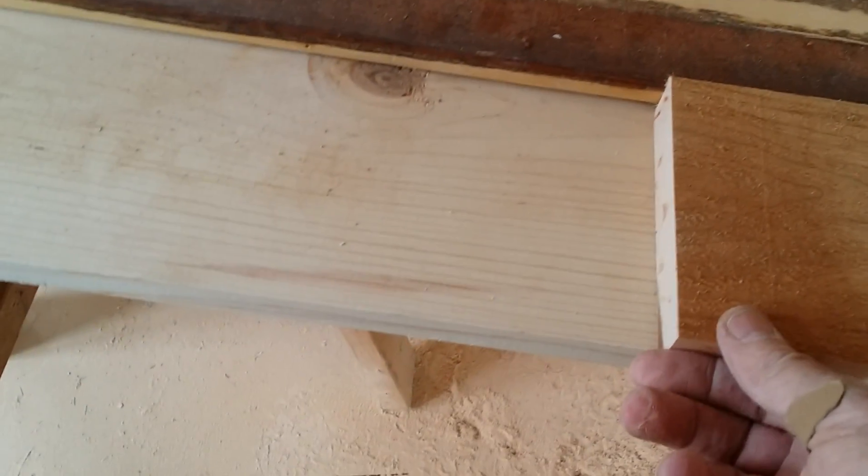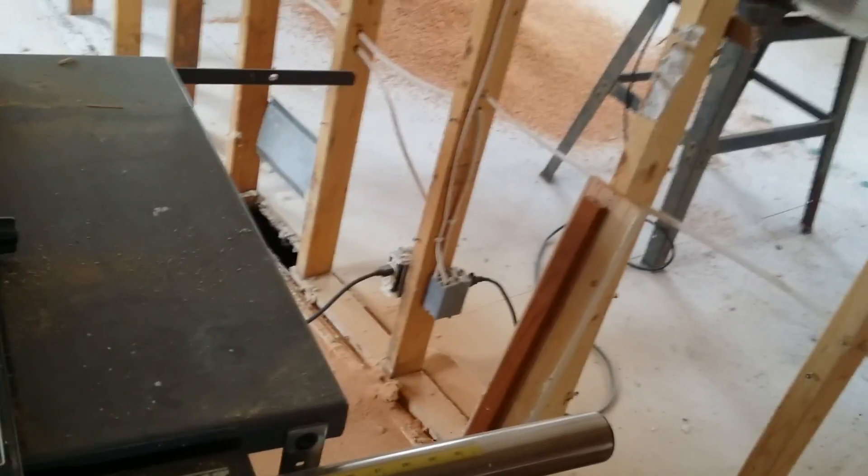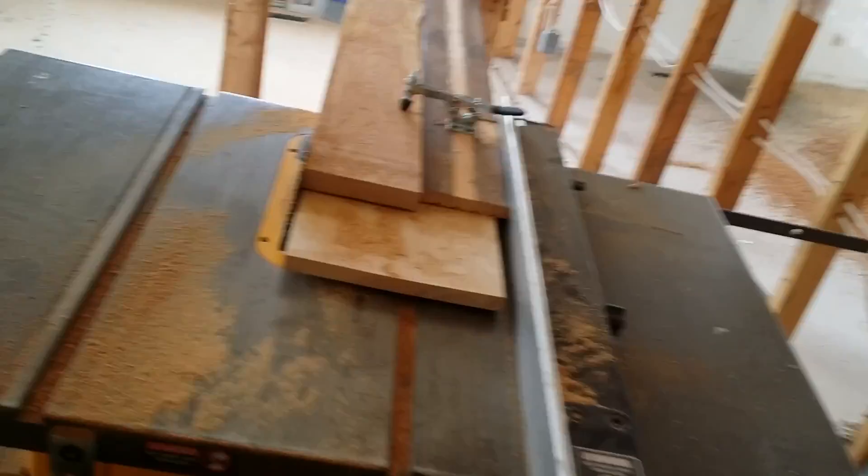What I try to do is have a little bit of extra wood from this board — which is my cherry board — so that when it hits my saw coming this way, it'll give me a straight edge. Once that straight edge is established, the next step for any one board is to take it over to the planer.